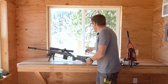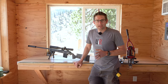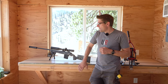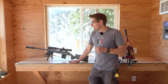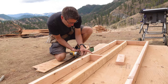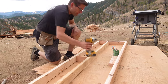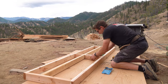What I've got is 24 inches of depth and 8 feet of length. You don't need any real special tools — just basic carpentry stuff. I went to my local lumber yard and got a bunch of 2x4s, a bunch of 2x6s, and a 4x8 sheet of birch veneer sanded plywood that I applied polyurethane to. The first step is to construct the outer frame: two 96-inch 2x4s, and 21-inch 2x4s for either end giving a total depth of 24 inches. That all gets screwed together using 3.5-inch exterior deck screws.